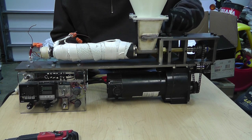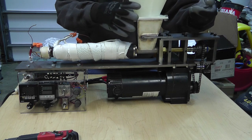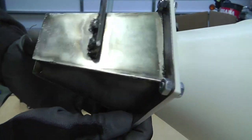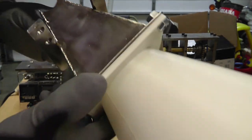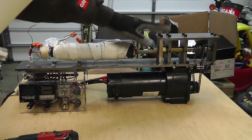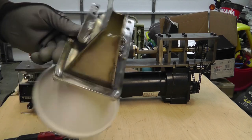I'm going to take this housing off and show you how I got this on here. Everything on the top part is just hand-tightened for now. Here is the hopper — it's just a stainless steel welded hopper. On the inside I've got a nice cut where it fits on my pipe, and I want to be able to remove this easily. These two pieces of stainless just bolt right onto the top, and then I 3D printed the top piece with little set screws that go into the polycarbonate tube.